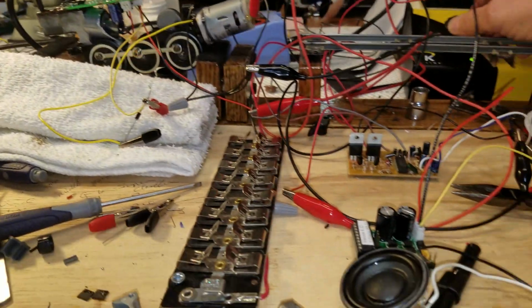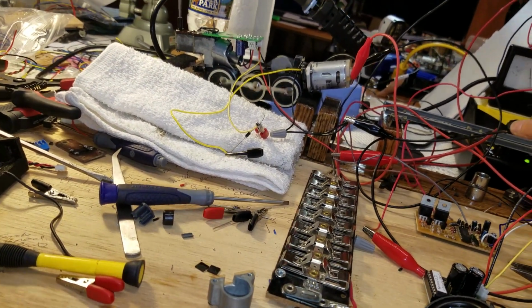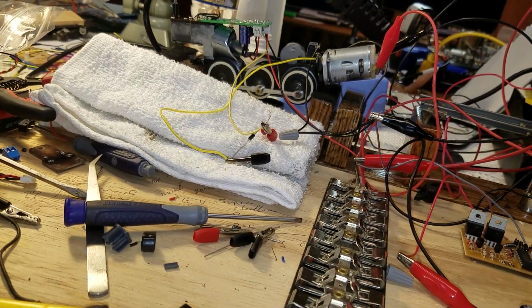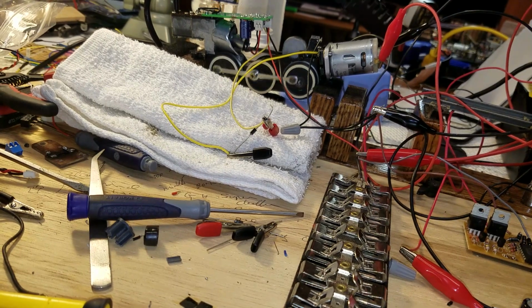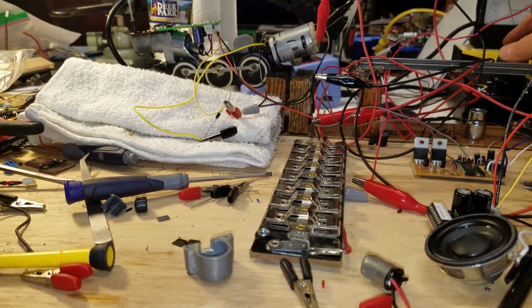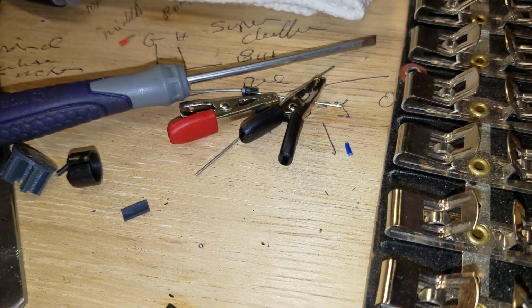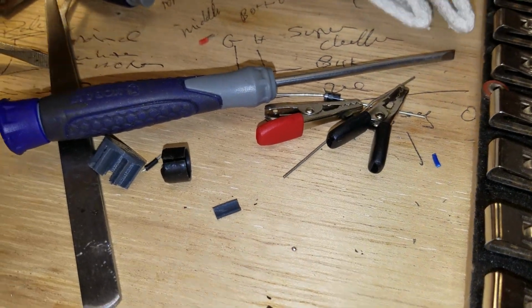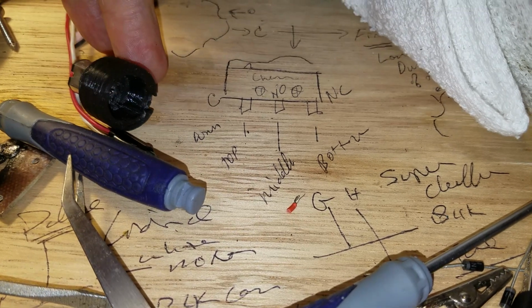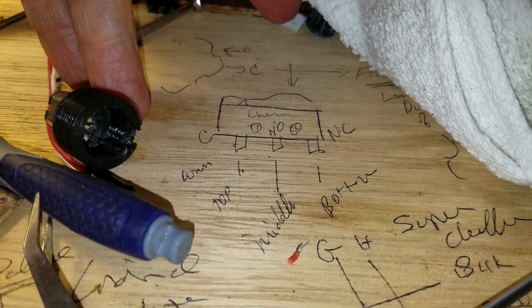My lab system worked out for me. I did a test earlier today. I could do a lot of tests quickly, verifying that I had the diodes in the right spot and all that, so I'm feeling really good about everything else. Now, the only other variation I have that I could be testing would be on my switch, my chuff trigger switch, which I've documented here, where I have a normally open in the middle and a normally closed out on the end. And I'm out on the end, so I'm on a normally closed.